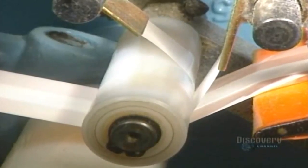Then, once the pad and bandages have been firmly glued together, the laminate will then be cut transversely to its machine direction in strips to the width of the desired bandage. Next up is safely wrapping the adhesive bandages.